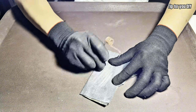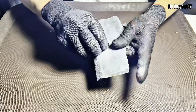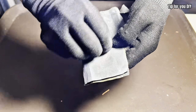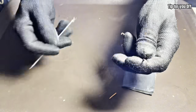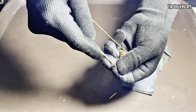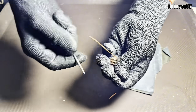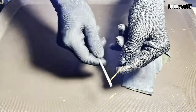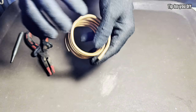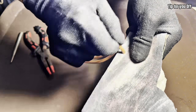The capillary tube is a very small, narrow copper pipe that plays a key role in refrigeration systems. When high-pressure refrigerant gas passes through this tiny tube, its pressure suddenly drops as it exits. This pressure drop causes the refrigerant to rapidly expand and evaporate, absorbing heat from the surrounding area.